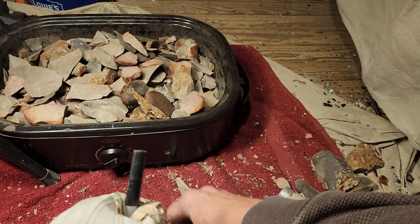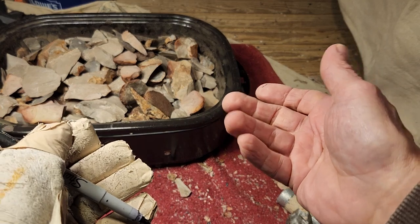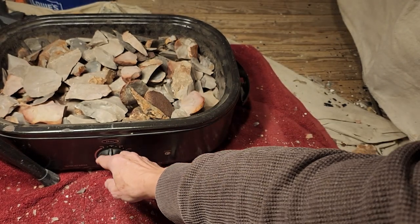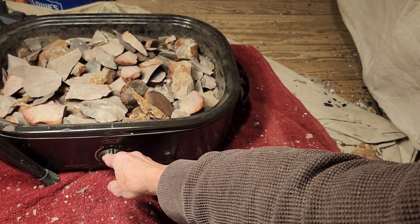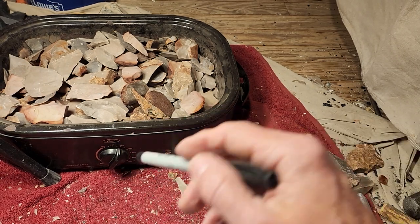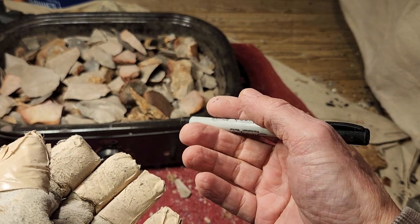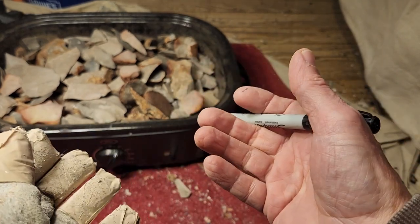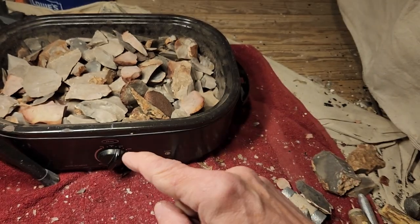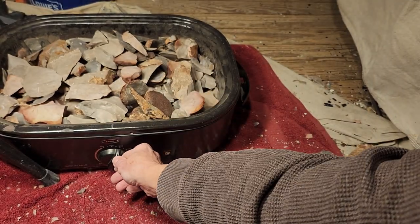So you don't want that to happen. What you do, you put it to 200 for 24 to 48 hours. Same kind of drying time. And then, once that time is over, increase it by 50 degrees. Where is it? 250. Let it sit for an hour or two or three. 250 is usually not hot enough to cook anything. 275 is where it starts to affect the stone. So you let it warm up, let's say for an hour at 250. And then you want to try the lowest possible setting for heat treating at first, and you bring it up to 275.